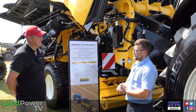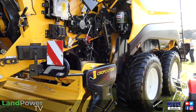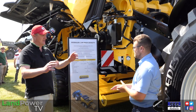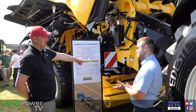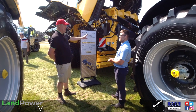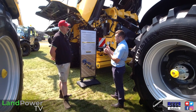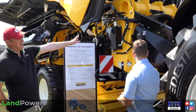The Plus range has the 870, 890, 1270 and 1290 models. The High Density version is more of a contractor spec machine, mainly targeted towards the biomass industry to achieve heavy bale weights. It does 120 by 90cm. There are two versions: the standard packer and the crop cutter. This one is a crop cutter with 29 knives, giving a theoretical chop length of around 30 to 40mm — a quite short chop length.